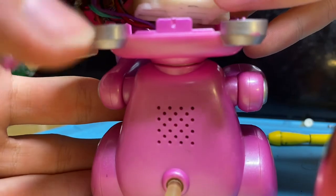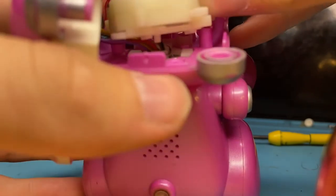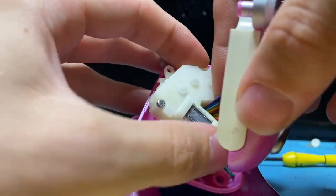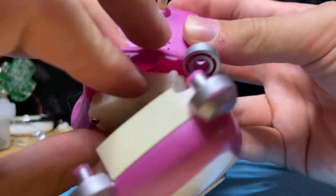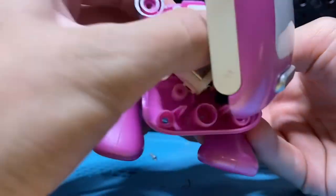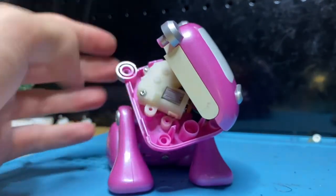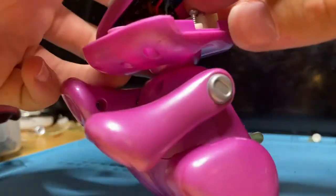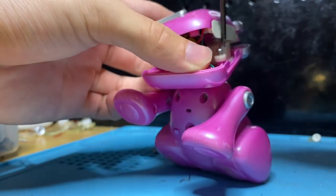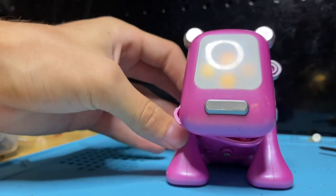It's going to line up right about here — that's where the spring is. It's kind of hard to see, but line it up with the spring. Push it — that is in. Be careful though, because you don't want to force the head in any way as that's going to ruin the spring you just made. I like to give it a quick test before we reassemble it to make sure it worked — and it very much did. Excellent.